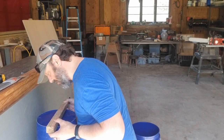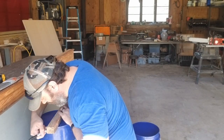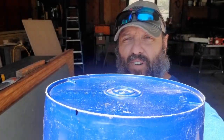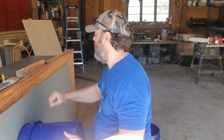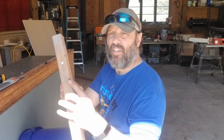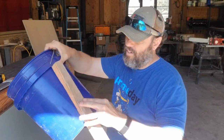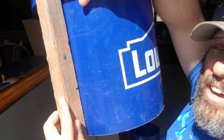So now we're looking at like the face of a clock. We're looking at noon, 3, 6, and 9. So now you see my little black marks on every quarter, okay? Simple, simple. Then, well, how high do I have to go? I took my same little handy stick and I got myself a mark. That mark, come to find out, if I take this and put it straight up against this lip, and I put that mark, I put another mark, now I have the exact height I need.